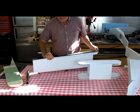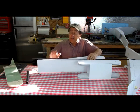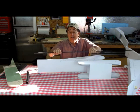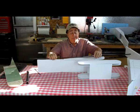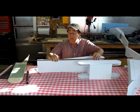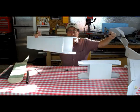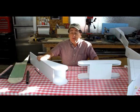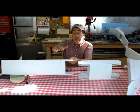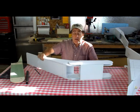The carbon fiber would overwrap over the top, the D-tube comes down, and it's all bonded together. This is actually superior because the foam and plywood provide a stiff backing. I made this wonderful 3D foam model and thought: much easier to build. Build the shear web entirely flat on the table, build these components flat, bond them onto the shear web. This has a shear web back here that goes into these fittings — and I was pretty happy with this design.